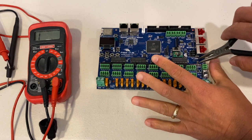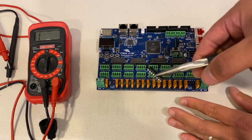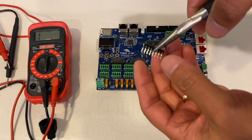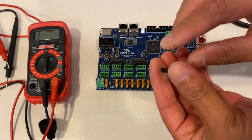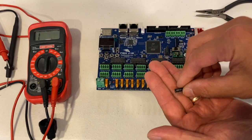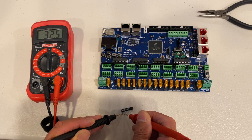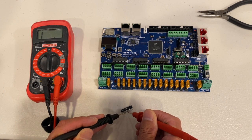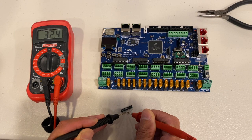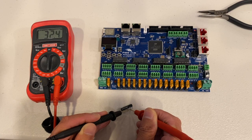I couldn't resist getting the voltmeter out. I'm going to very carefully lift out the resistor network — on one side it's all black, and on the other side it has the lettering for 33 ohms. Testing it out: 32.6 on the first resistor, 32.3 on another, and 32.4 on another. So yes, a whole new 33-ohm resistor set confirmed.